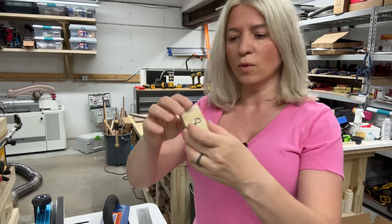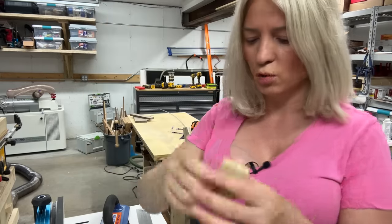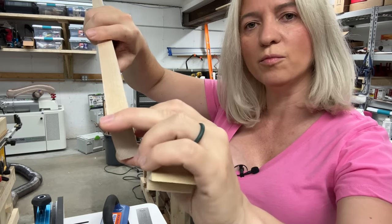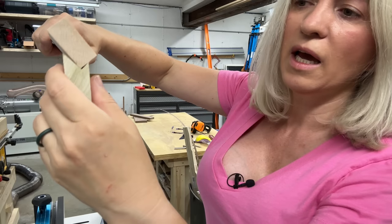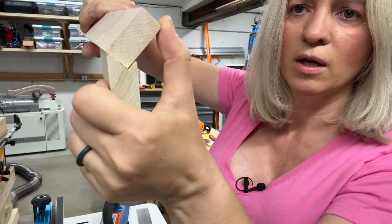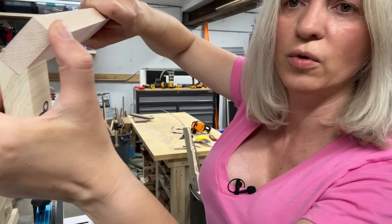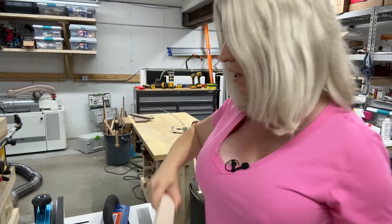Once we cut the profile, it's going to look something like this. The way it works is you take another piece of wood that does not have a BIRDSMOUTH profile, just a straight 90 degrees. And this will fit in here something like this. Then you see we get this really cool joint that is very, very strong because you have a lot of gluing surface over here.